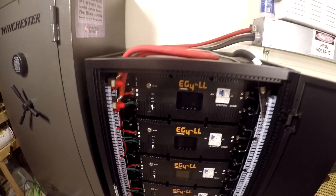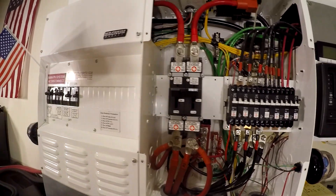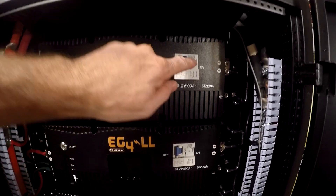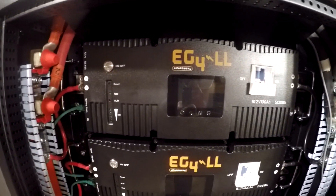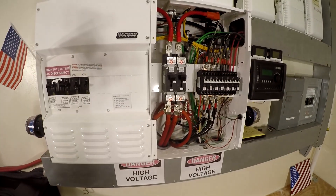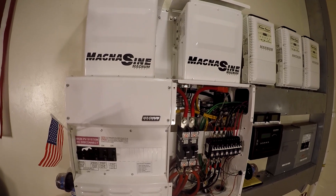This is how I'm going to do it — I'm not saying this is how you should do it. Basically I'm going to turn on both inverters. The switches are on, there's no power to it yet. When I turn this on, it'll go through its pre-charge cycle and charge everything up because it's all connected. If you had these switches off, it would not do a pre-charge cycle on the inverters, and that could be a problem, although these probably have built-in protection.